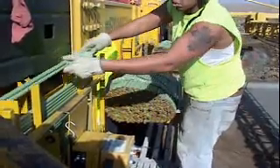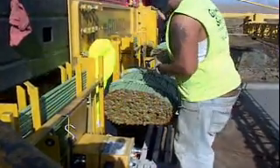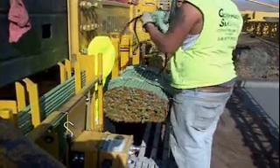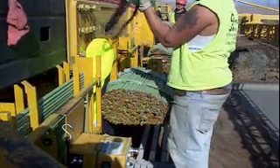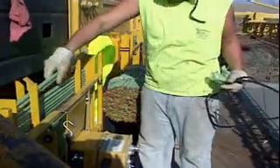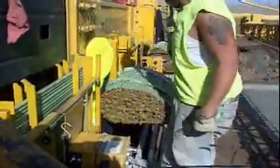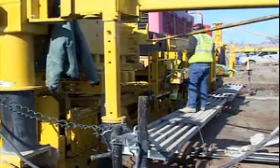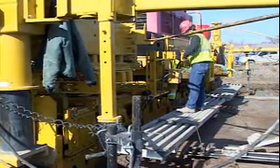The bar inserter is rear loading and front inserting for ease of use, allowing the attendant to maintain the system from the paver's work platform. This paver had two inserters, and one attendant easily handled the loading.